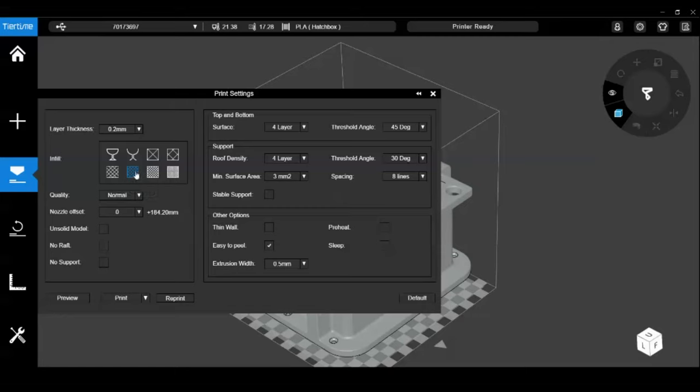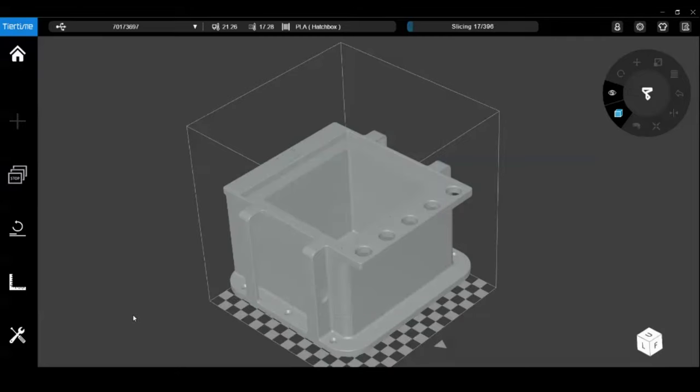I usually use about 65% infill. If you're not familiar, 3D prints don't print solid. They use a lattice mesh interior with solid shell interior, exterior walls, roofs, and floors. The material that I'm using is Kodak PLA Tough. It's a good quality material. It's not cheap, but the supports and rafts tend to break away fairly easy. So let's take a look with these settings.